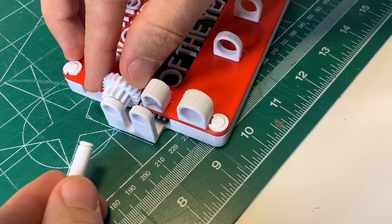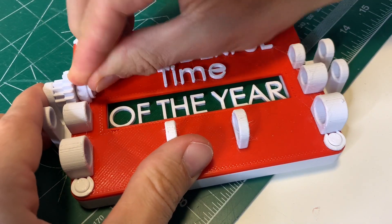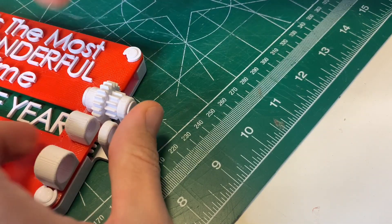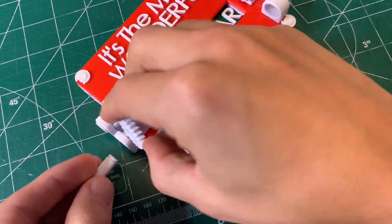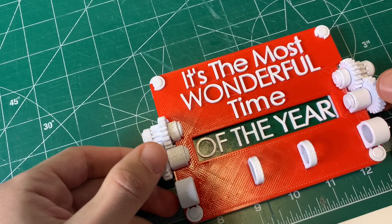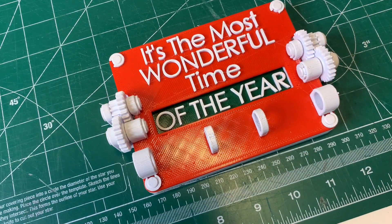Let's move on to the gears. Start by placing this compound gear in this orientation so the big gear is meshed with the rack on the slider, and then C-clamp those into place. Next add these middle gears — pins, C-clamps — and repeat on the other side. Then just make sure everything is moving with the gears. As long as you have it popping back, you know you're good to go.